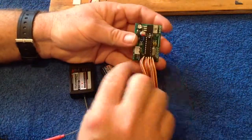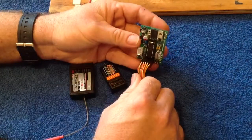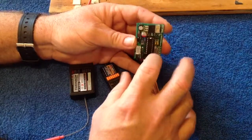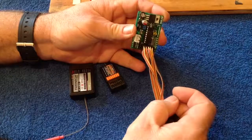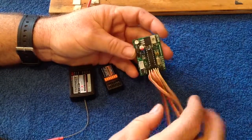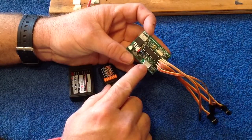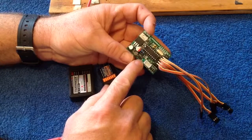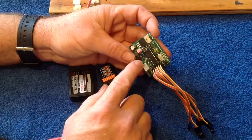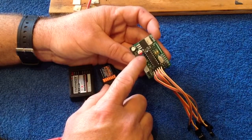Down the bottom here, these five pins, I've connected them up so that it saves time. This is your servo connector cables. The servo input comes in on these five ports here. This port here is for connection to your RX-18. We have an indicator light that'll let us know it's ready to turn on. And importantly, the other thing you need to be aware of is this jumper selection set here.